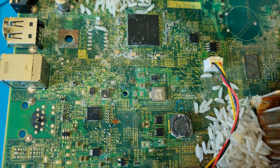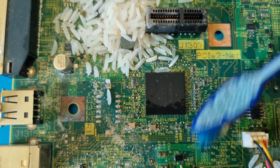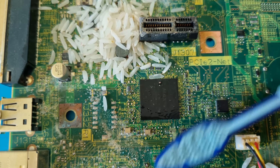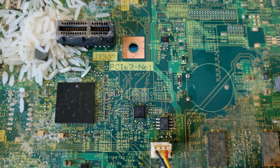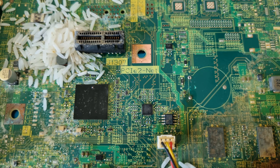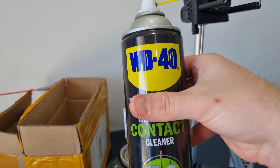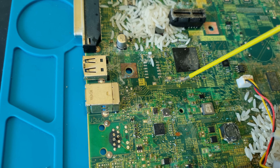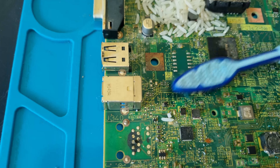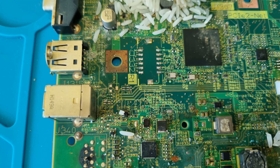You can give the IPA a crack. You can absolutely tell the difference. It's pretty close to the vinegar, although you're better off using IPA because the vinegar's not designed for a circuit board. Contact cleaner — all three of those seem to do a decent job.